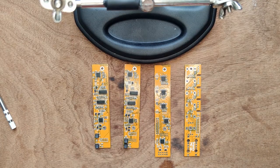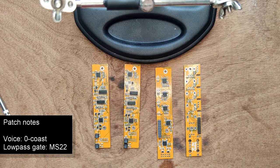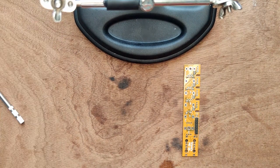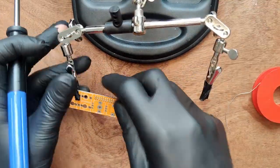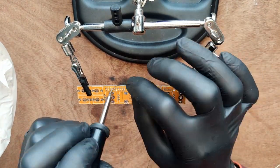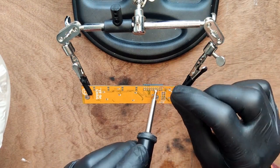We're now moving on to the through-hole components. Place the 20-pin male and female headers. Now two 10-pin female headers. Solder the corner pins first while holding the board down on the bench. Then solder all the other pins. Repeat this process for all the headers you just placed.